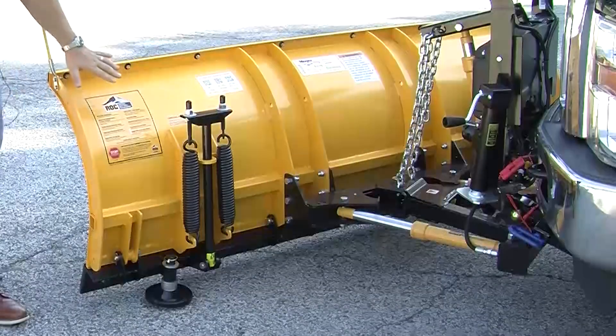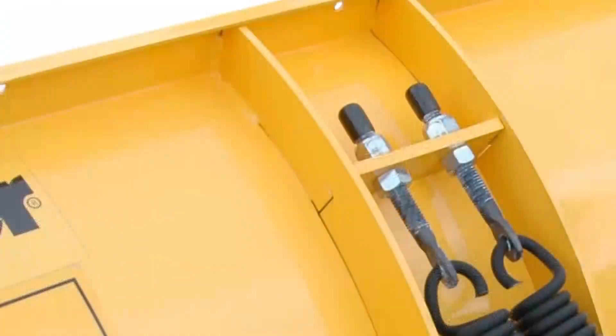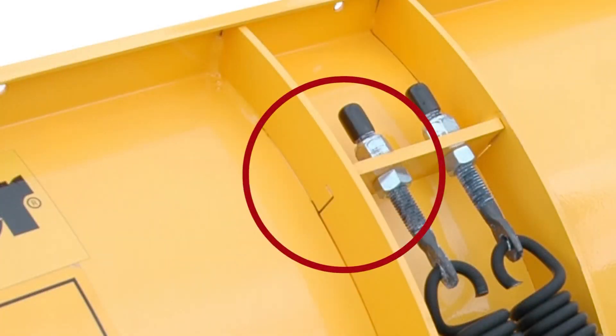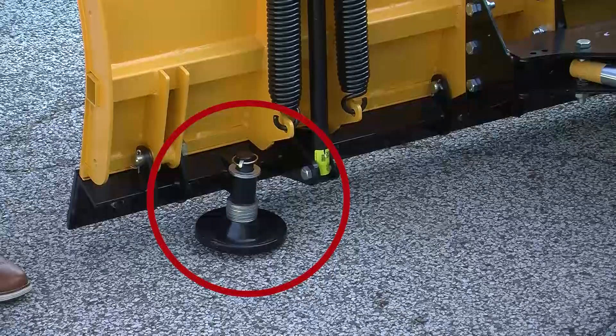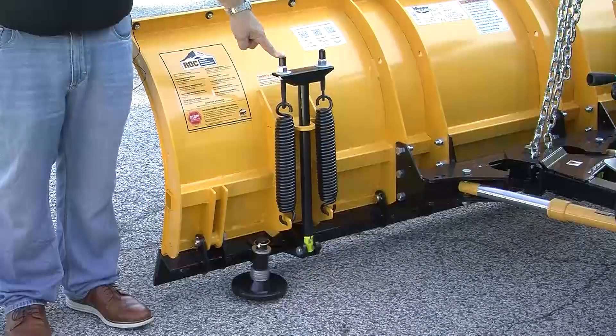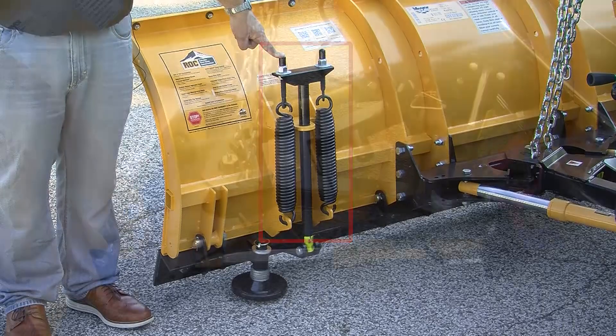Let's talk about the back side of the Diamond Edge series. Like all Meyer mold boards, they're designed and manufactured with a slot and tab construction, ensuring that you have the strongest built product in the marketplace. All Meyer straight blades come standard with adjustable shoes. Meyer Diamond trip edge systems use a draw type spring versus a compression type spring, giving you the ability to adjust or change the spring tension within minutes without any special training or tools.